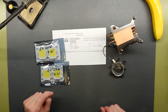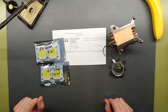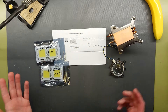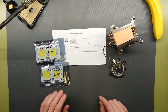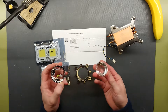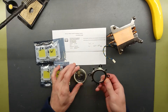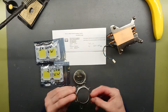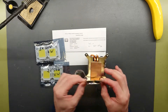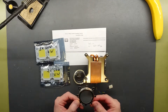They came tested at 36 volt DC. I bought these from Germany because I wanted to have an easier time returning them in case of a failure. If I bought these from China, they would probably not come tested and I would not be totally sure what I was getting — at least here I got a few more details. For the lens I ordered a set here. It comes with a small plastic reflector, a 60-degree glass lens, and a lens holder. The lens holder fits nicely on the outer part of the heat sink, and the LED itself can sit on the inside of the copper core without hitting the two heat pipes when mounted.